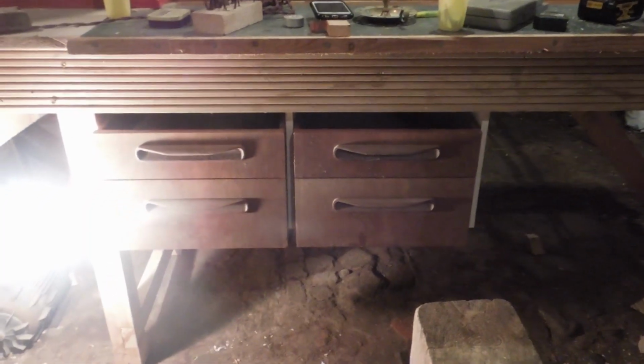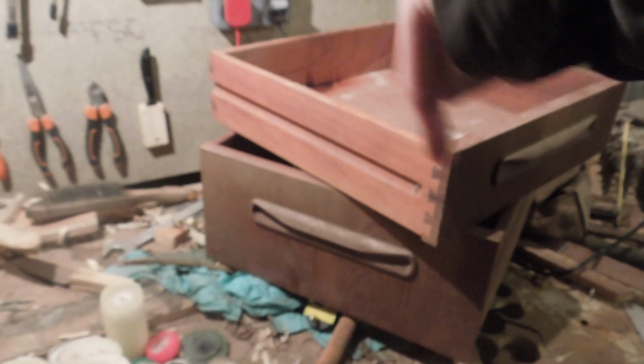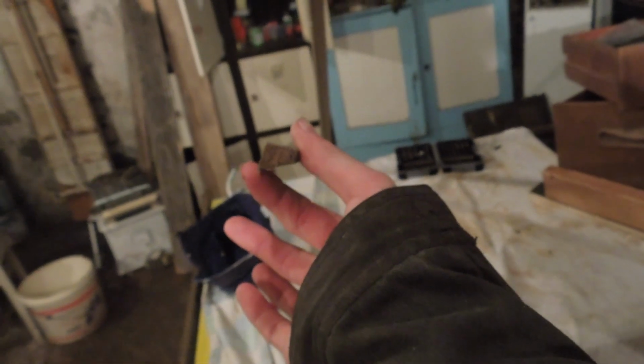Now these here dividers are a bit flimsy, so I need to stiffen them up. The fit looks good and it's nice and stiff. The drawers already have the runners cut in, so I can make the other half out of these here oak strips that I have. They're a weird shape, but I'll rip them down, and it's a pretty useless shape anyway. And then I can just stick the runners onto the walls, which are nice and stiff now.